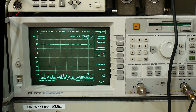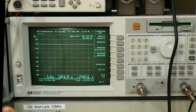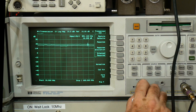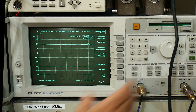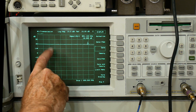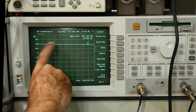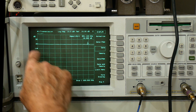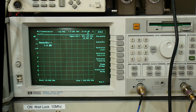Let's hook this up to the amplifier output and bring the input to the input. Let me clear the display. It was at zero and now it's up at 20 — so it's a 20 dB amplifier. Whatever we put in, it's going to be 20 dB higher. So it's measuring correctly, but we want to measure very accurately. Let's zoom in — we'll change the scale to 1 dB per step because we want to see very fine things.